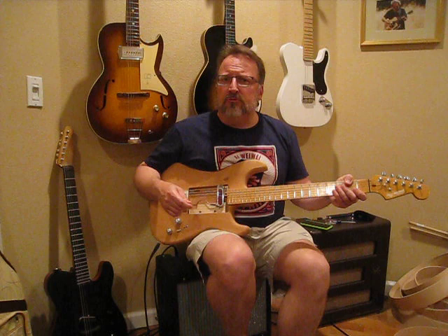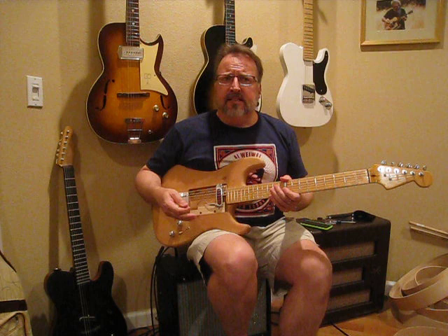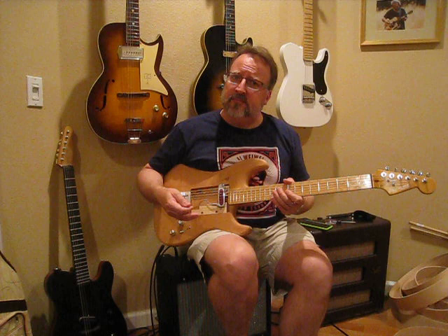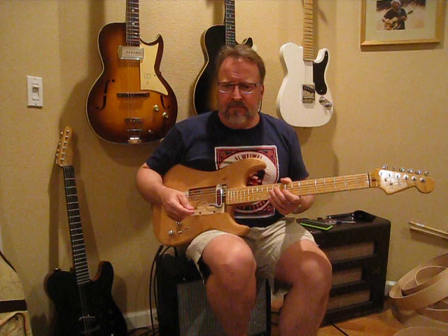It meters at about 12.37K and inductance is over four and a half henries, so it's got a lot of push to it, a lot of grunt. Being noted for being a jazz pickup, I expected it to be very mid-forward — and it is very mid-forward, but it's sane and clear and punchy at the same time. It sounds very boutique-y and high-end; it's got an interesting tone. It's kind of special. I can see why these things are expensive.